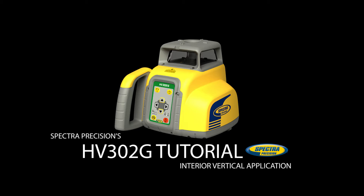The following video shows how to establish a vertical reference for interior applications using the plane lock mode and beam plunge feature; how to place the laser with the wall mount at the first alignment point; how to place the HL 760U receiver using the marking notch at the second alignment point; how to establish a safe vertical axis in plane lock mode and mark the required line positions using a second receiver or target plate; and how to use beam plunge for 90-degree layout markings.